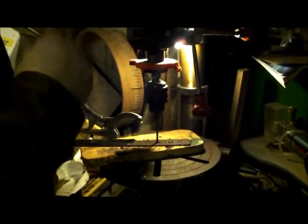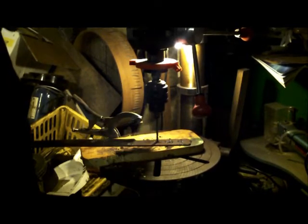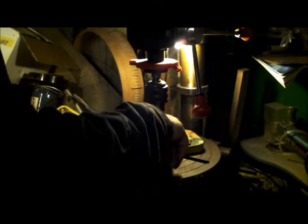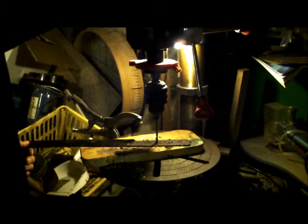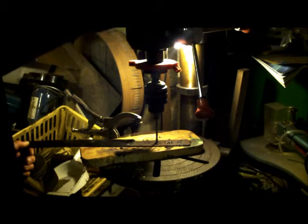If I allow the drill just to sit on the edge of the hole, and then I allow the drill lube to pool around it, it won't disappear down the hole quite so readily. It stays there. So rather than put it down the hole first and then drill, I let the drill go on the hole to sort of block it up, and then put the lube on.